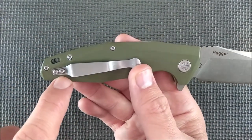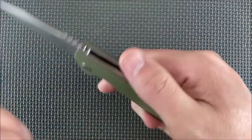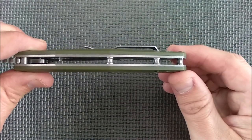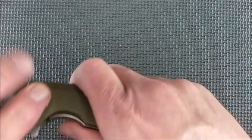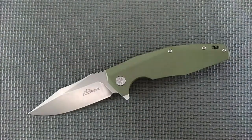The rest of the screws are T6 Torx in the number six size. We've got open pillar construction with three hourglass-shaped pins that are screwed together to hold the handle together. There is zero skeletonizing inside this knife, and that's why the weight is a little more than some people want.